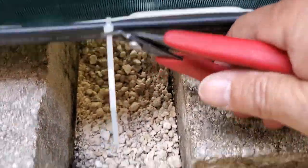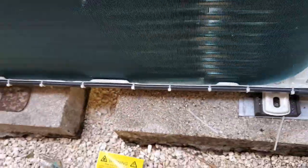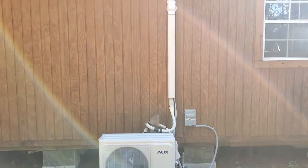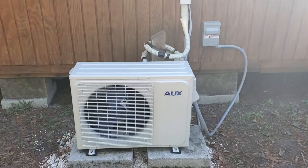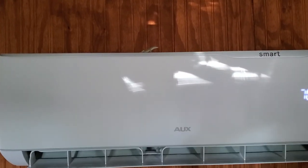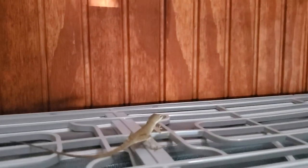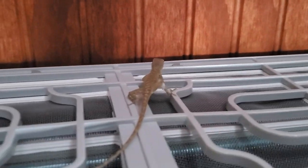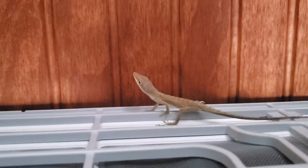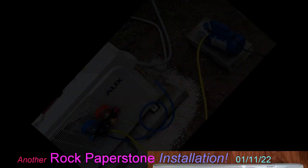I also had to install a GFI outlet to plug the cable into. I spent about $30 on parts and half a day for the installation. This mini split actually works well down to freezing temperatures and I was able to maintain about 65 degrees in the building with a supplemental electric heater that turned on at about 68 degrees. Overall, I've been pleased with the performance of this budget mini split. It would have been easy to spend twice as much for one with the same capacity, however the more expensive ones do have higher SEER ratings. Thanks for watching and I will see you on the next one.